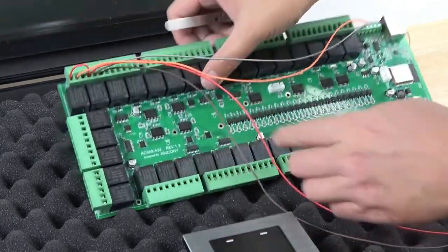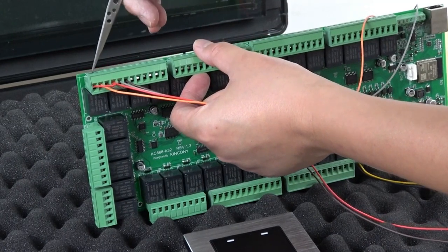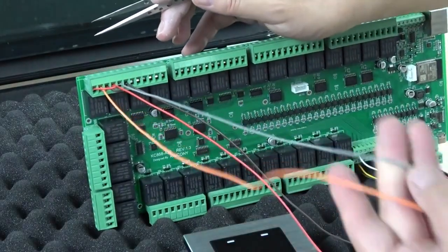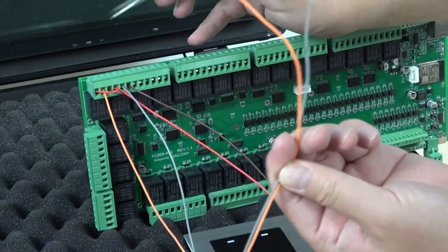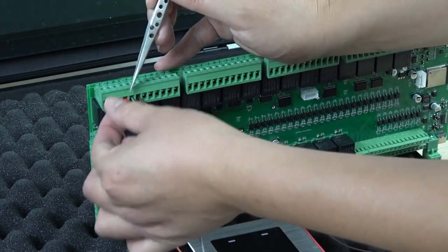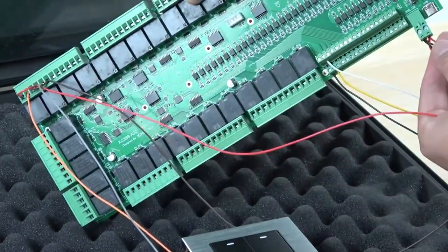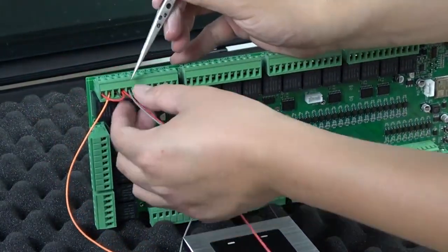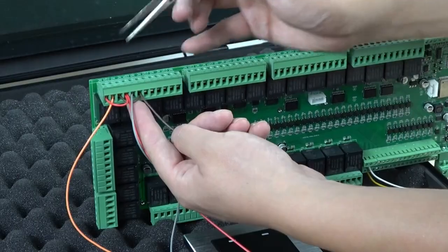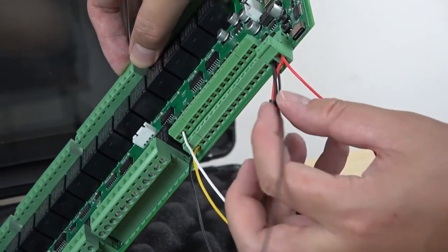And you can see here we have two relays. We have used relay 1 and relay 2. Each has COM, normally closed and normally open. We will use this 2-1 and connect it to the motor. All of them are connected with the two relays' COM. The normally closed terminals are connected together, and here the red is connected with 12 volt from this power. And here you can see this color, the normally open terminals, are connected together. These two are connected together and connected with the ground, the black ground.